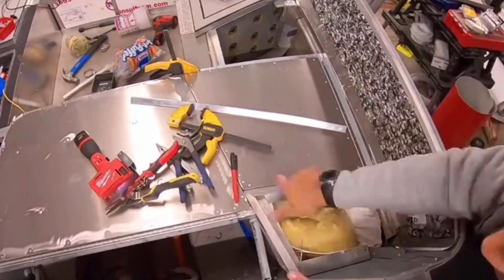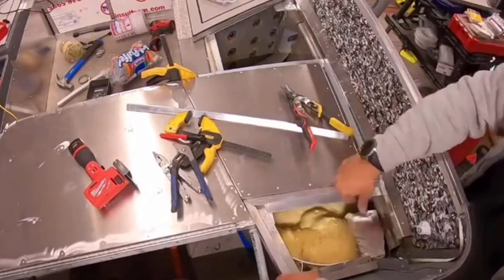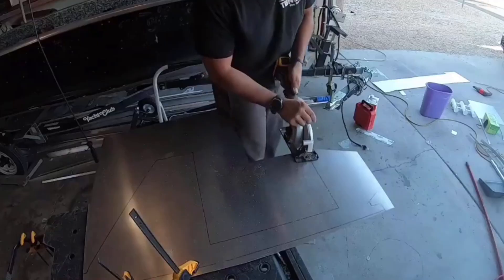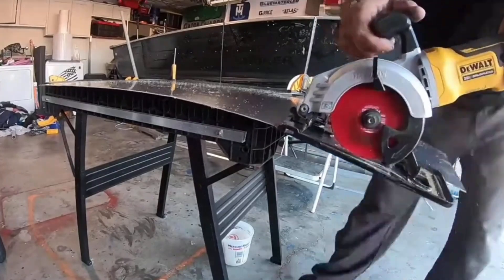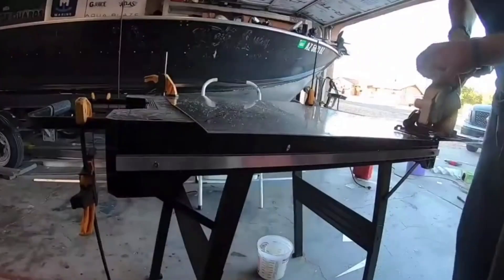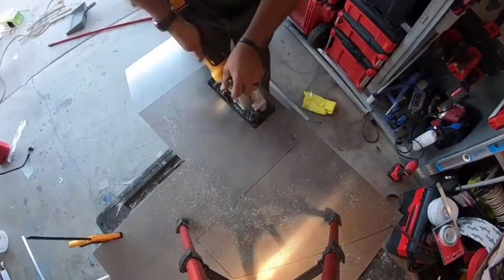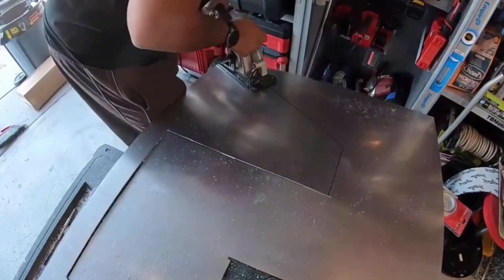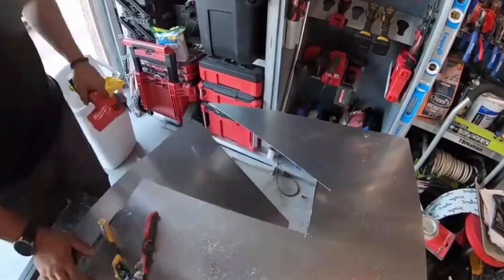We just bend and pull and rivet the aluminum however we need to. It's fairly simple and very quick because you can just do it right there. You can pull it out, reposition it — if it doesn't quite fit, pull it back out, reposition it again, stick it on there until it all fits good in your eyes, and then just trace it out on the aluminum. I recommend a circular saw with a Diablo blade — it seems to cut the aluminum quite nicely. A lot of other people also just use metal shears, which is pretty good, but if you're trying to get inside the aluminum sheet so you don't have to waste it, the metal shears become very taxing where they kind of need a precise line.